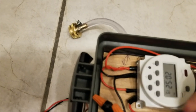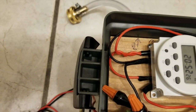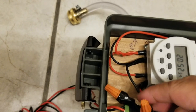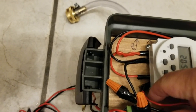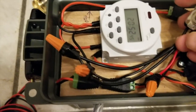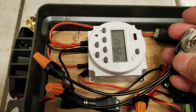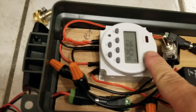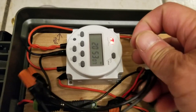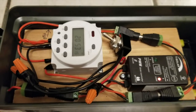The timer comes from the schematic for wiring the switch side to the power. There's one common line that goes from the switch to the power, then the hot red line goes into the other side of the power, and you've got the neutral and the other side of the switch coming out, hooked to a physical switch. So this switch will override any timer output. Right now it's off, but this timer also has a manual switch — that means it's on. And if I switch it on, you'll hear the pump go. I've set it up for every day around 4:30 for 20 minutes.